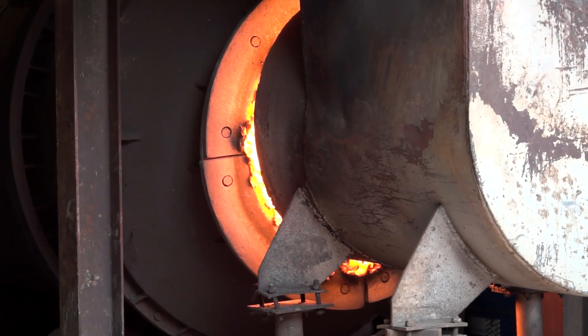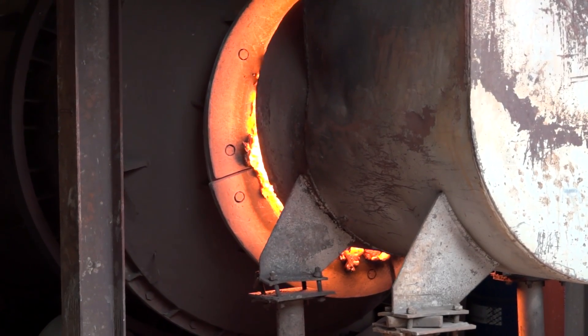I'm assuming the metal goes in here — that's the furnace, yeah? That's the big fiery furnace. The metal goes into that oil-fired rotary furnace — we're atomising the oil into a spray with a recuperating cycle so it gets hotter and hotter, melting the iron. What sort of temperature? We're getting up to about 1,350–1,400°C in the furnace itself, melting the iron down to liquid form.